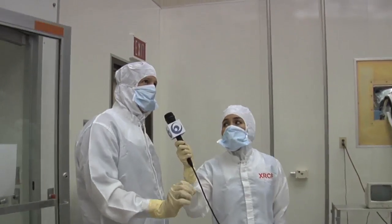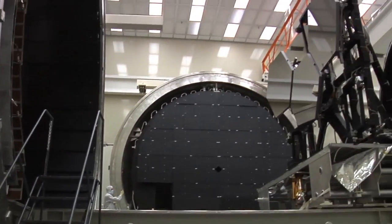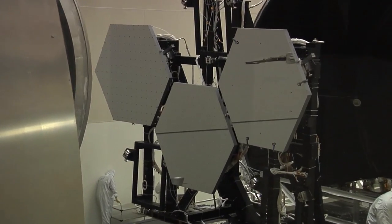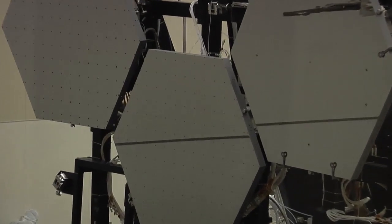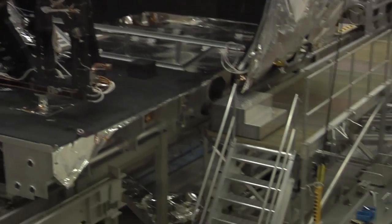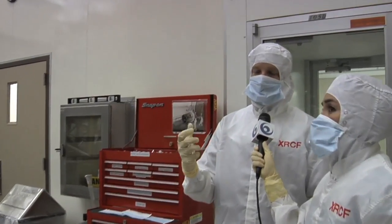We're just about to pull the entire test stand assembly into the vacuum chamber with three James Webb mirrors aboard. I noticed there are just three mirrors — why is that? I think James Webb has 18, right? Right. The James Webb Telescope is made up of 18 mirrors. We're going to have each one of those mirrors come through here twice. The first time through, we actually measure the deformation as a function of temperature as we transition down to minus 400 degrees Fahrenheit. The second time through, we verify that the mirrors actually perform correctly at that temperature.